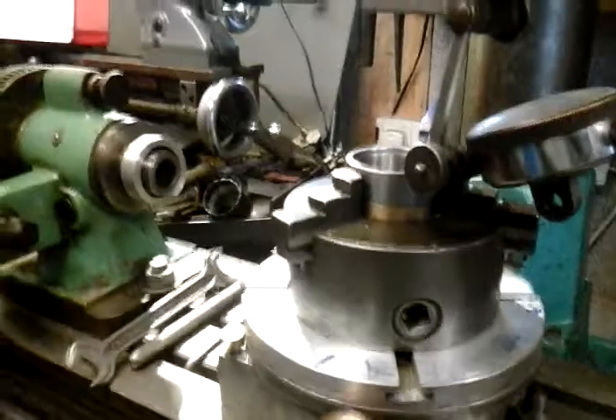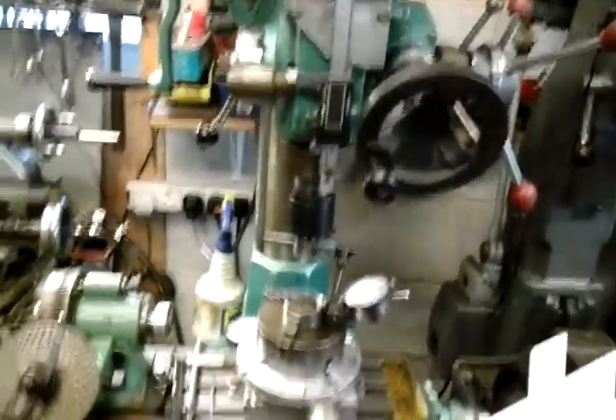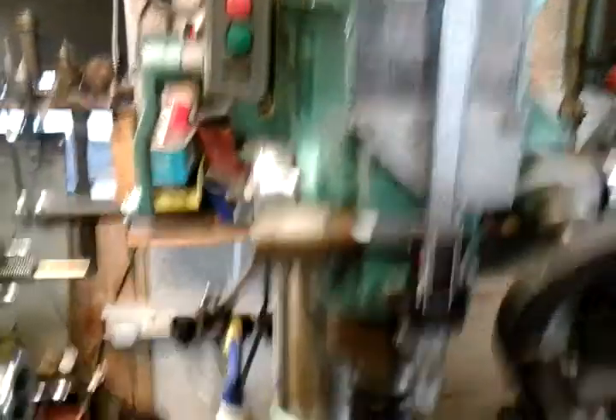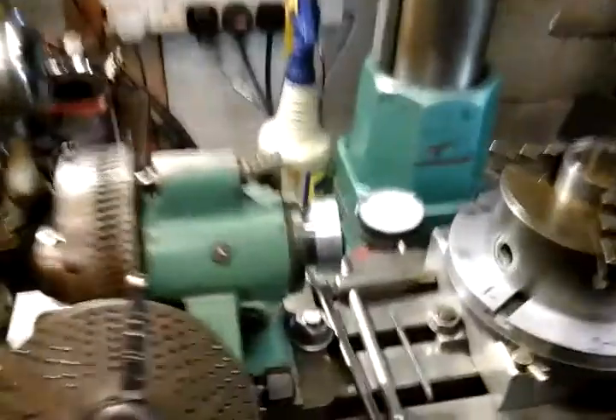I'm over at the milling machine now. It's only a budget milling machine and it's fairly old, but I can produce accurate work on it. There are a couple of methods you have to use to get that accurate work — I'm not relying on my dials anymore because it's an old machine and the screws are probably worn. So I've fitted a vernier caliper to my quill and the same vernier caliper on the x-axis. For accurate and intricate work I just use a clock gauge to get my y-positions.